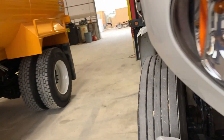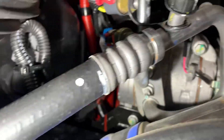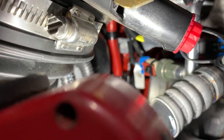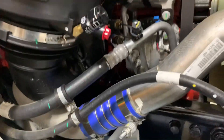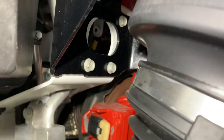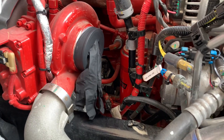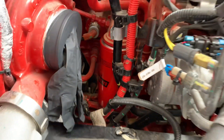Let's go around this other side and look at the oil filter. We've got a totally different air filter. Let's find the oil filter on it - she is back there with that white tag. That's where that oil filter is. So you either remove the air filter, take your boot off the air filter, get your boot off the turbo, and take off the turbo and air filter by removing those four bolts. Take them out of your way to get to the filter. Put the air filter out to see the oil filter a little better and get to it a little easier.